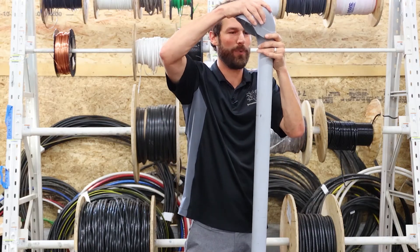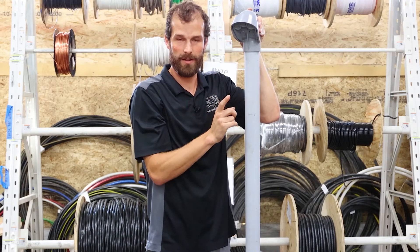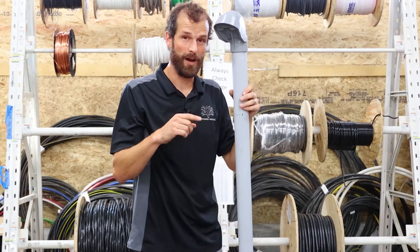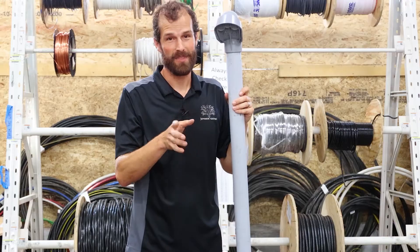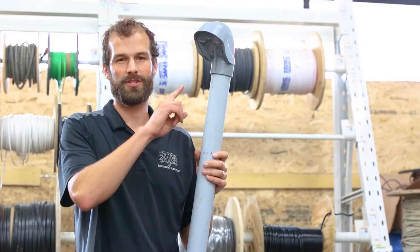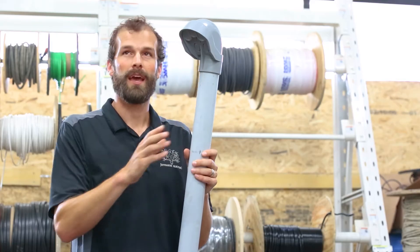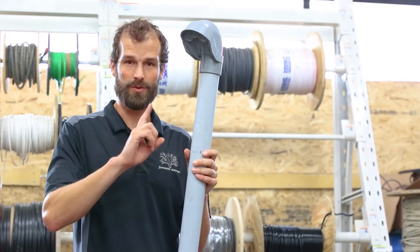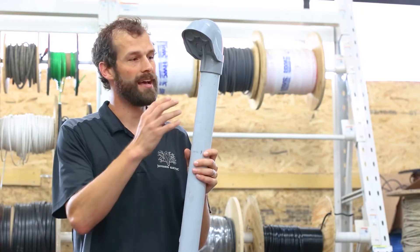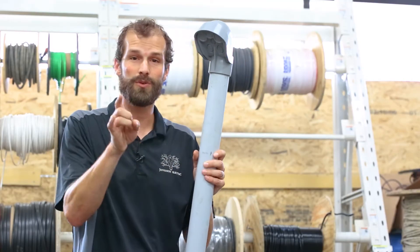This is a two inch PVC weather head. This is the point at the top of the service riser where the customer's responsibility stops. The wire exits this weather head and at that point converts to utility overhead wiring and becomes the utility's responsibility. One thing you'll note about wiring transitions at the weather head is that the utility overhead wiring is often a much smaller wire gauge than the building wire, because the utility overhead service drop is bound by different rules — not the National Electrical Code that governs the electrical contractor.